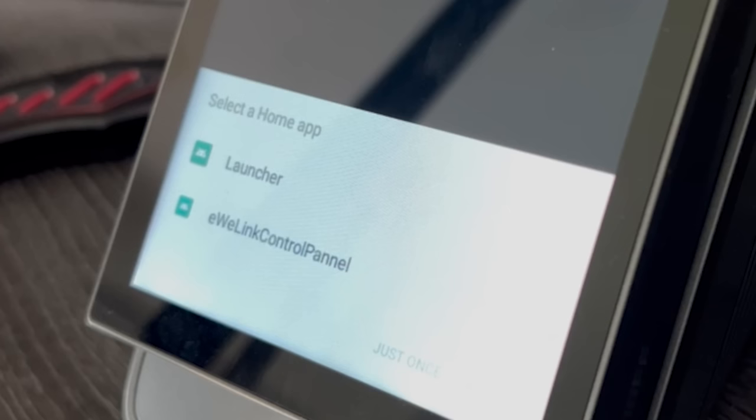The final steps are to head back to the dashboard using adb keyevent 3, then go to Settings and then Display. Inside Display, scroll down, choose Advanced, and select Sleep. You can set how long the device stays on without interaction — timeouts range from never sleep up to 30 minutes. In my testing, having the device sleep at 30 seconds with the proximity-triggered brightness also set to 30 seconds has been the most reliable combination. If the device falls asleep and the proximity sensor doesn't wake it, you'll need to remove power or take off the front faceplate to restart it.